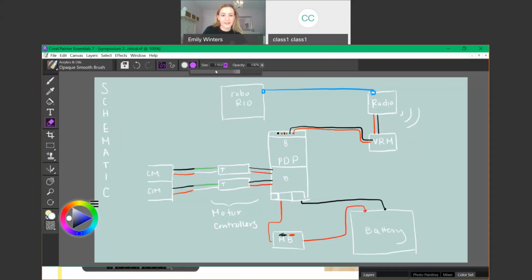Or you could do something called a network switch. Everything that uses Ethernet on this robot is actually connected to the radio. So let's say you had a vision system and the Roborio and another vision system. That's too many. So you can add a network switch, which just basically gives you more Ethernet ports. We'll draw it right here, network switch. And then if you have anything else in the robot that needs Ethernet, I'll put it right here for a bit of ease. Anything else that needs it, you've got more ports. That makes sense. So like a Limelight would need one of the Ethernet ports.